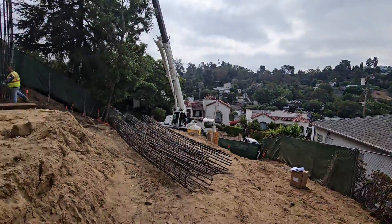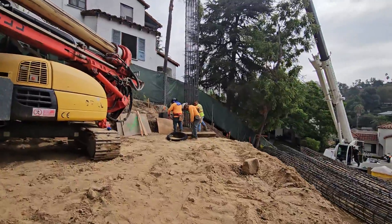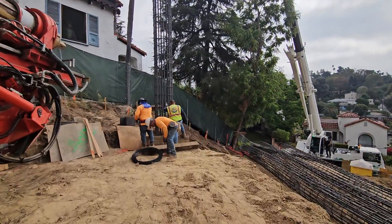In order to keep these cages away from the soil, we have to have a minimum 3-inch clearance of concrete that surrounds these cages. So we use wheels — as we start to lower this cage into the ground, we snap wheels onto the rebar so it keeps even spacing around the cage. I'm going to walk over and show you what this looks like. As we lower that cage in, we snap these wheels onto the cage.